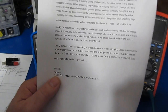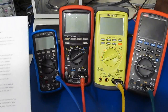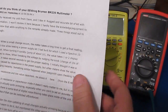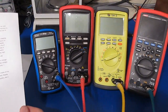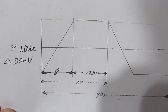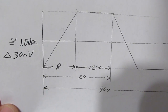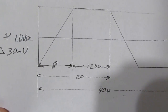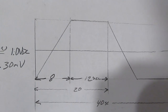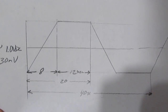Unfortunately, it doesn't seem like I'm able to replicate what Crumble has seen. So it's possible he's doing something unique with the meter that I'm just not finding — they don't provide a whole lot of detail about exactly what they were doing, and it's very possible they just have a unique test case that I didn't stumble into. Currently I'm switching between two different voltage levels with a difference of about 30 millivolts, and the average DC voltage is roughly a volt. My period is about 40 seconds, with a ramp time of roughly 8 seconds and a hold time of about 12 seconds at a 50% duty cycle.